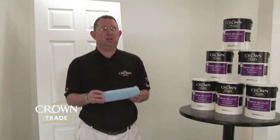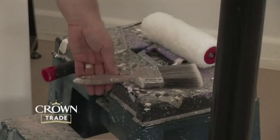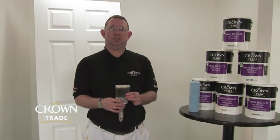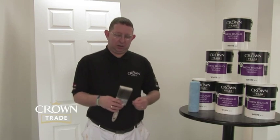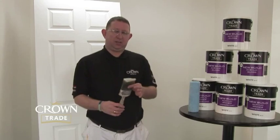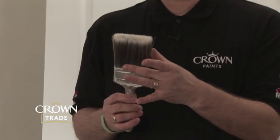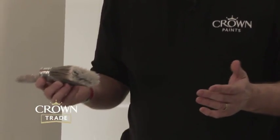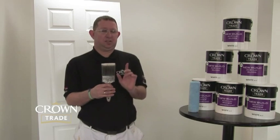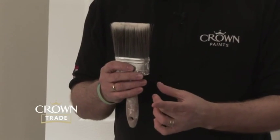We also recommend a good quality synthetic brush. The reason we specify synthetic is that the paint just clings to the outer surface of the bristle. If you were to use a pure bristle brush, under the microscope it's like a mini straw — over a couple of hours the paint travels down the bristle. When you take a break and come back, the bottom section of the brush isn't workable and becomes hard, meaning you end up dragging the paint rather than applying it. With a synthetic brush, the filament is solid — it doesn't trap paint inside, it just clings to the outer surface.